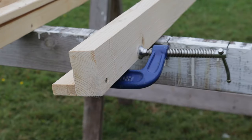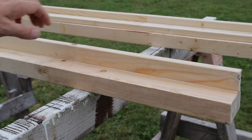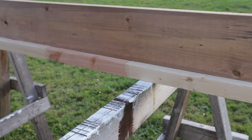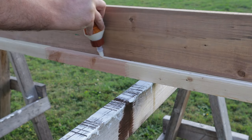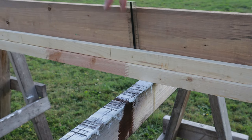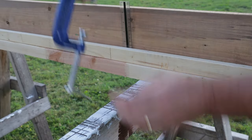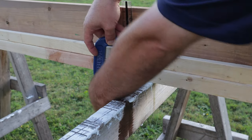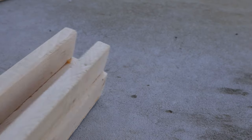That's the side facing the post so you'll never see these screw ends again, and it'll keep it nice and secure. Once I take off those clamps, just before I apply the second 1x2 that will make up the second rail, I use one of the slats — one of the horizontal portions of this screen — just to get the spacing right. I'm putting in a ruler there to create a little extra space so it'll slide down the channel perfectly. Once clamped, I roll it over again and apply screws to keep this second rail secure.